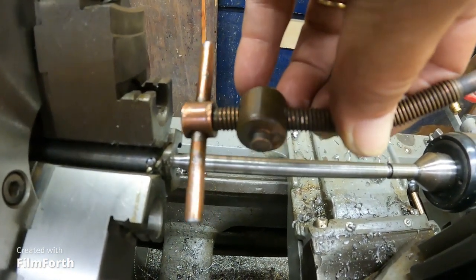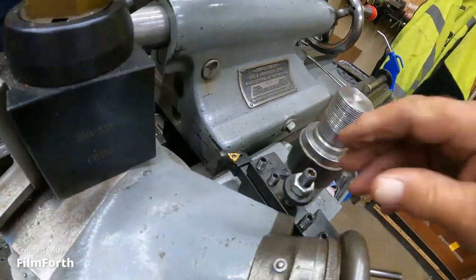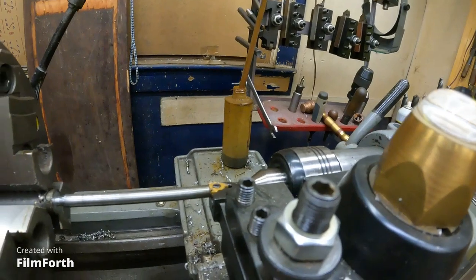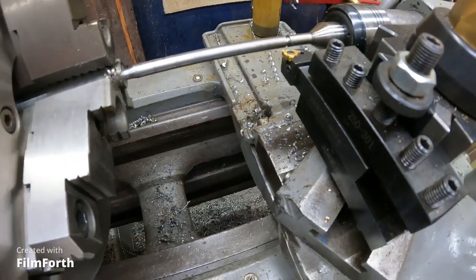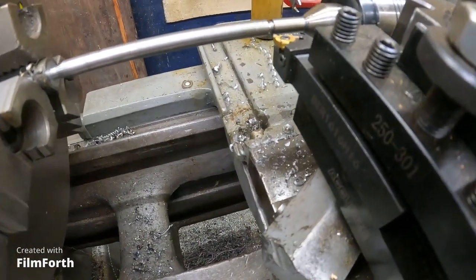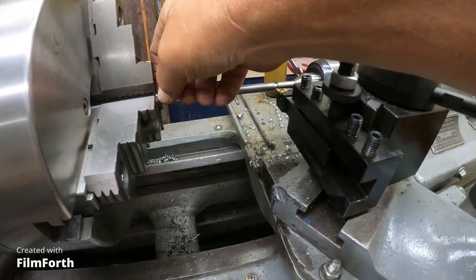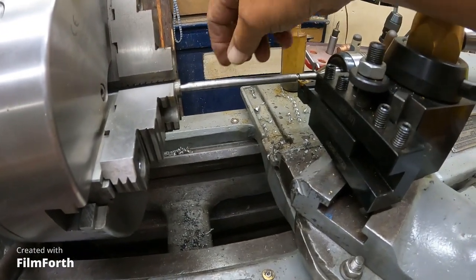Somehow. I need to hacksaw that nut off there. Need to cut those threads. So I'm gonna go with the indexed, there we go. Index cutter. I think it's 16 threads per inch. So we'll get set up to do that, and you'll have to come back and see the next video to see the threading.